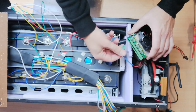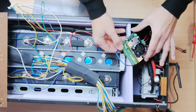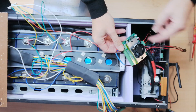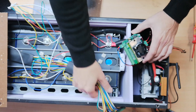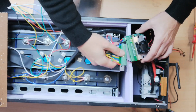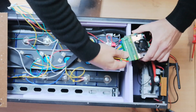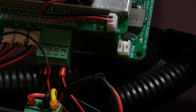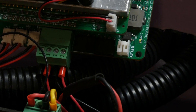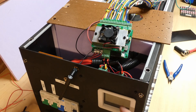So finally it's time to connect everything up. That's the two-pin power lead to the new cell monitor board. And then it's time to put in this 17-pin connector — it's quite difficult pushing these in, they take quite a bit of force. And then once it's powered up, the LED will flash to prove it's connected back to the controller and the voltage readings will appear.